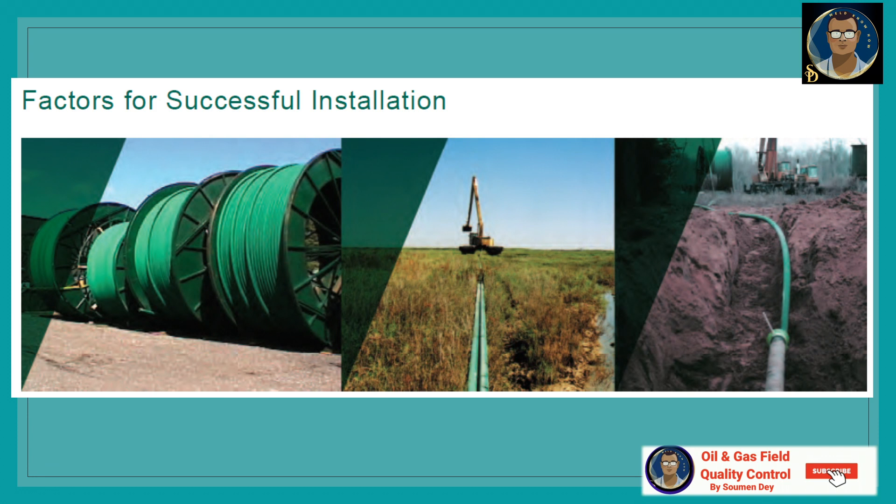The fourth instance is line pipe damaged by improper backfill. Backfill that contacts the line pipe should be loose dirt containing no heavy or sharp objects. The trench bottom should also be smooth with no sharp objects, marl, or stones beneath the pipe. The pipe should first be shaded with loose dirt for the first one or two feet of cover; large rocks or objects can then be placed on top. Where local soil conditions make it difficult to control backfill quality, additional steps should be taken such as grading, using imported padding, or jacketing the pipe. When soil is frozen, extra care must be taken to prevent frozen lumps from contacting the pipe, and the ditch should be filled in a controlled manner that does not introduce lateral or shearing loads.